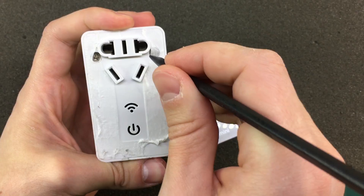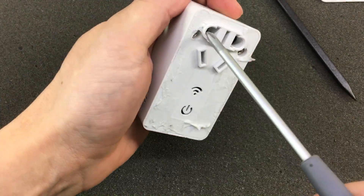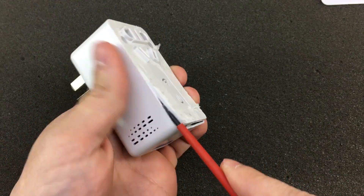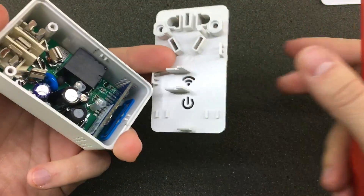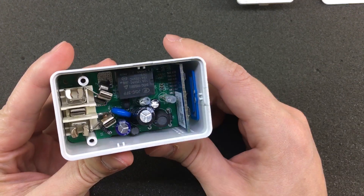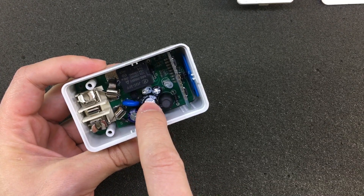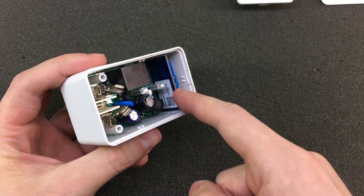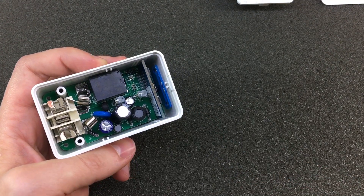Just as expected, we have a couple of Phillips screws under this faceplate. Let's take those off. Looks like they also have some retaining clips — I hope I didn't damage anything in there with my screwdriver. This piece also comes off, and we can see inside the device. Right away I notice this two-board construction. We have onboard power supply as well as the relay on our first board, and we have a secondary board here which is probably where all our logic and wireless interface resides.